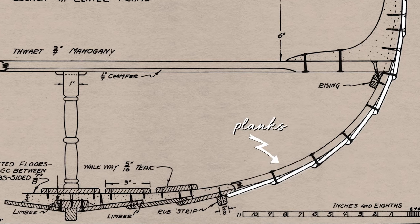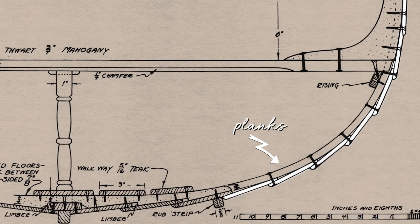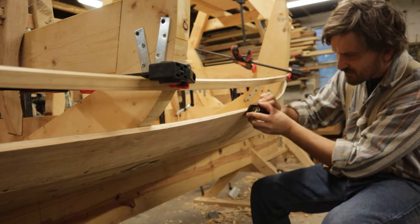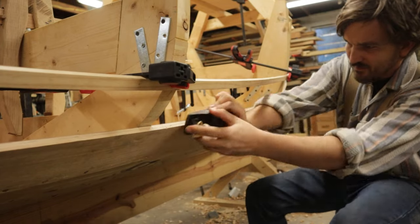What it means to plank a boat lap strake is, first, that each plank will be overlapping the neighbor below it. Secondly, it means that in order to achieve the shape of the hull, the tops of each plank are beveled to change the direction of the succeeding plank. When planking a boat lap strake, what you're essentially doing is coopering out the shape of your hull — basically building a big, sexy, open-ended barrel. However, this is an oversimplification of the lap strake planking process.